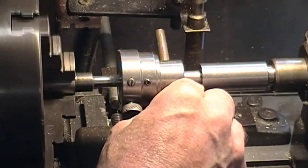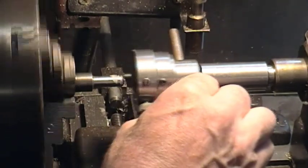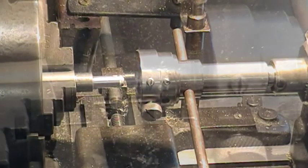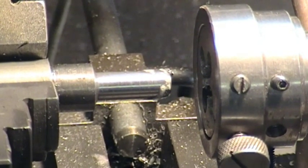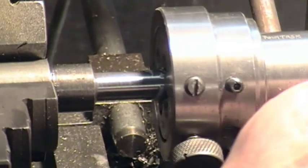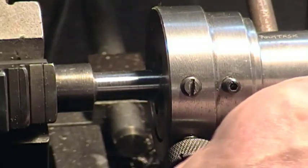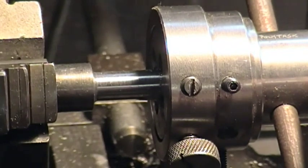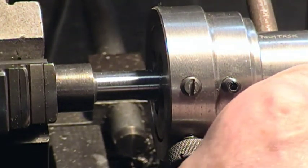What I'm going to do is to slide this out onto the end. Now to start, turn with a little bit of pressure to the left. Now back off. You can see we've just got a cut starting. So we can get in a bit closer - don't go in too tight or I'll lose focus. We've just made a very short start. Turn that and feel a slight engagement. Now apply a bit of pressure this way, and of course the die holder is able to slide out of the mandrel - or arbor.